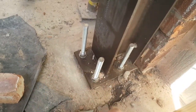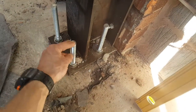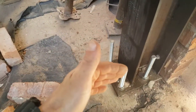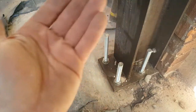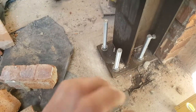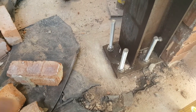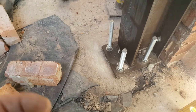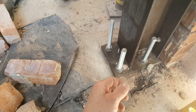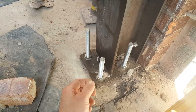Put your steel into position, get these rods and literally just knock them in. Now if you're cutting from a long bar and cutting sections off, always put your nuts on first and your washers, then do the cut, and then pull your nut over the threaded bar — it should thread it back. Otherwise, if you don't, and you try to get a nut on because it's been caught and it's flat, you might struggle to get the nut onto the thread.